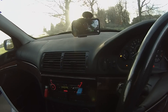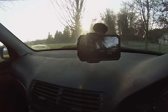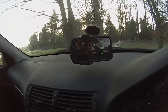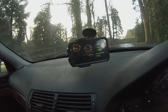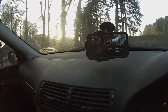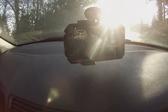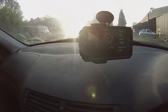So this is me just driving along the straight here. I've got about 10 or 15 amps going in now. I'm coming up on a little bit of a hill and trying to accelerate — I push the throttle and can get up to about 30 or 35 amps, but no matter what I do the car won't draw more than this. There's a bit of a hill coming now and we're just going to really struggle to come up it. I'm pushing the throttle here and really struggling to climb the hill. This is kind of what we've got at the minute — just no real power.